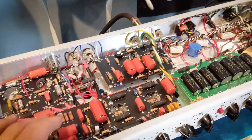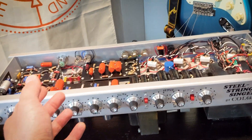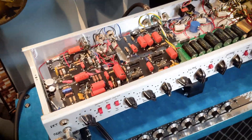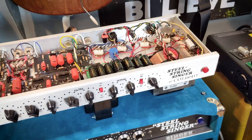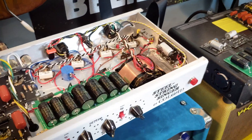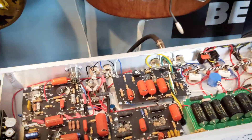So I was switching back and forth between the amps, and if you've watched my other videos you'll know I think my main amp has the lowest noise floor — sometimes I forget it's on and then I whack the guitar strings and I'm slapped in the face with tone. This new amp was a little buzzy at first and I couldn't figure out why. The transformers are Hammond — that's one minor difference — while the others are Classic Tone, both paper wound. Then I noticed the power transformer was buzzing at about the same frequency as the buzz coming through my headphones.